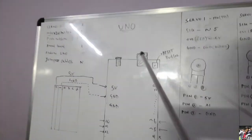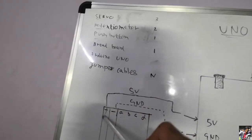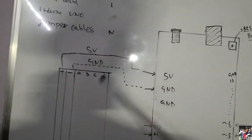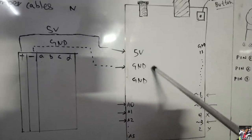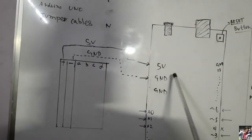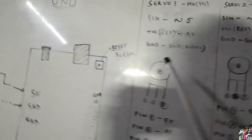Let's take a quick look at the connections. They're very simple. First of all, we have to separate the 5-volt and ground lines by multiplying these pins using the breadboard. We connect 5V to the positive bus and ground to the negative bus. Since there are around 35 to 65 rows in the breadboard, you basically multiply 5V and get as many pins as the row count — the same situation applies to the ground pin.